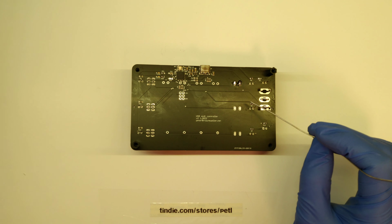The 8 needed screws, those are M2.5 to screw on the faders. Those are things that you definitely need to do before soldering them on, because if you've already soldered them, then you will most certainly not be able to screw them on in place correctly, because the holes for soldering the faders on are actually a bit bigger than would be needed, and that I've done on purpose, so that you can actually screw the screws in beforehand and not be limited by some kind of tolerances or different manufacturing stuff that would hinder you in doing so. So 8 screws it is, 8 screws are in.